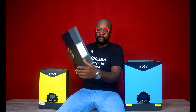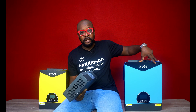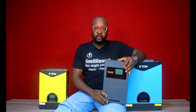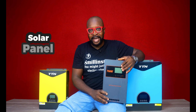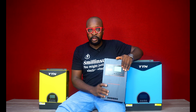Do not get it twisted. A hybrid inverter simply means that it has a charge controller on the inside — it has an inbuilt charge controller. A charge controller essentially regulates the energy that comes from the solar panel so that it doesn't overcharge the batteries. Essentially, it cares for the battery.